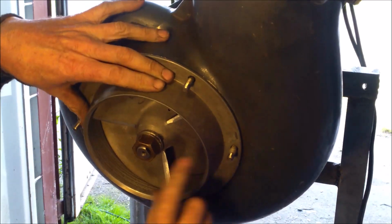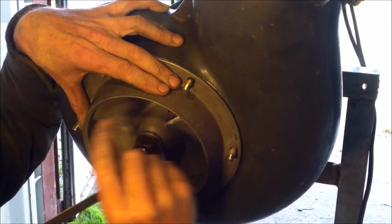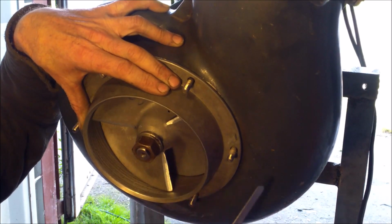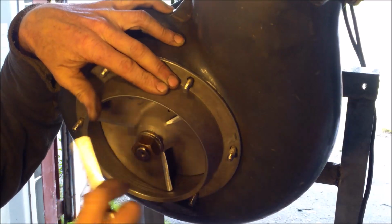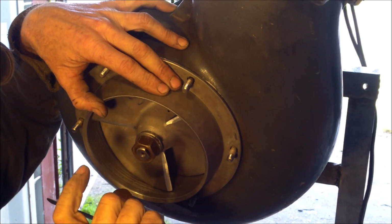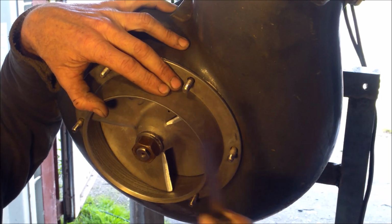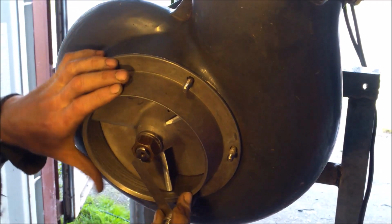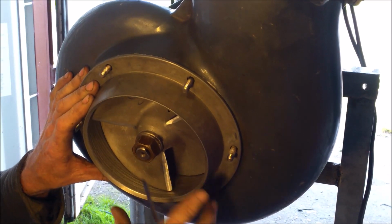Especially when you have a damaged impeller, damaged liner like this that you rebuild, you can have just the tip a little bit recessed and the rest a little bit sticking out. So always with the gauge. You can take a piece of plastic, for example. Normally the guides in their toolbox have a piece of cap coming from peanut butter, and it's about 0.032. So you have to check the gauge everywhere, and if it's okay, we can close it.